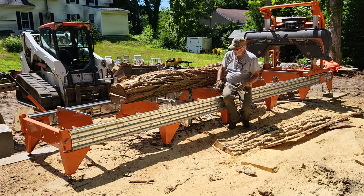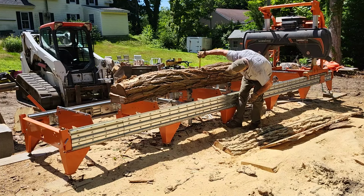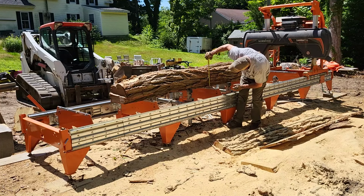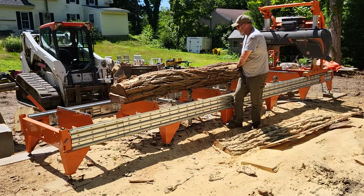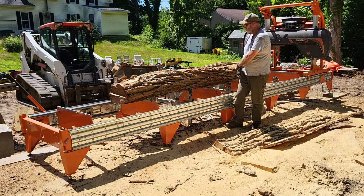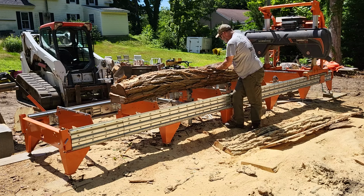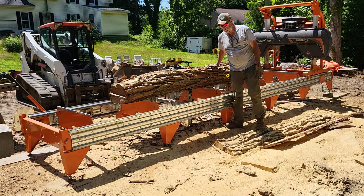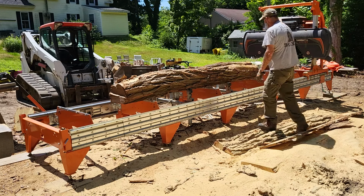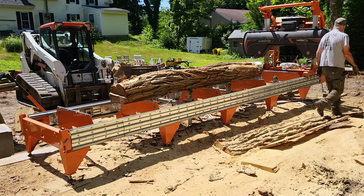So I might just double check here. So I got 2 inches to the top. I got 12 is 10. Think maybe just to leave myself a teeny bit of playroom, I'll start this cut at 9 1/8. That's what I'm going to make this cut at. Give myself another eighth of an inch. And 9 1/8, and then we'll see what happens.